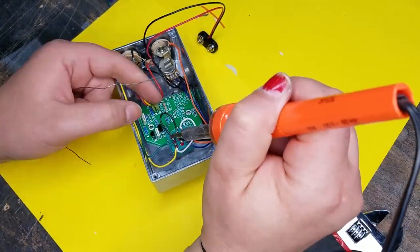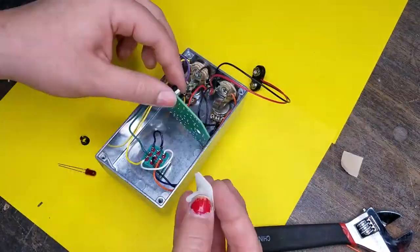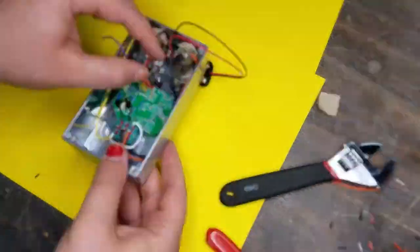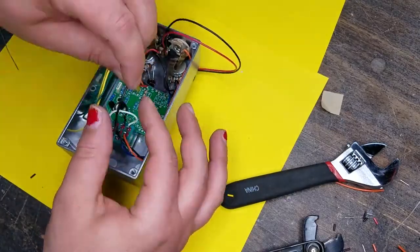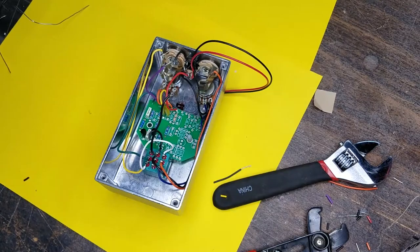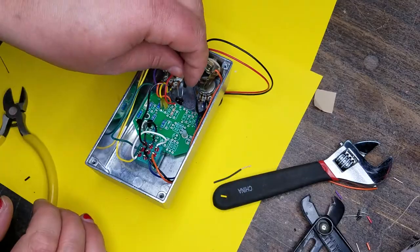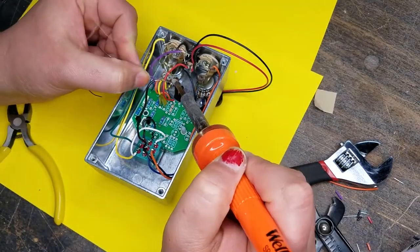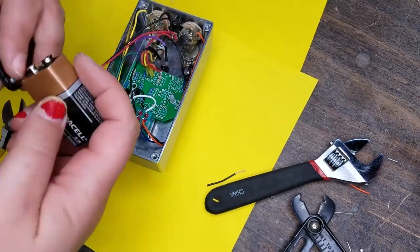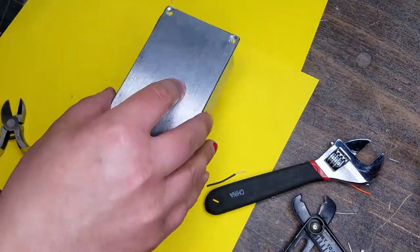We're doing the foot switch now with the LED coming in. With LEDs I like to use something called heat shrink — I pre-tin the LED and the leads to the wire, then slide on these little pieces of rubber and blow-dry them so they shrink and protect the wires from shorting. There's the battery and the lid.